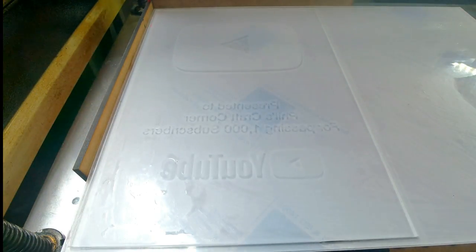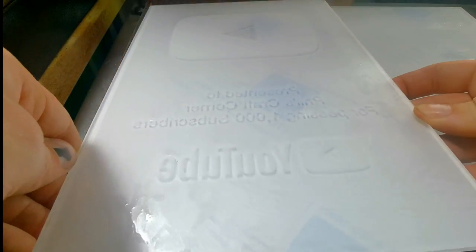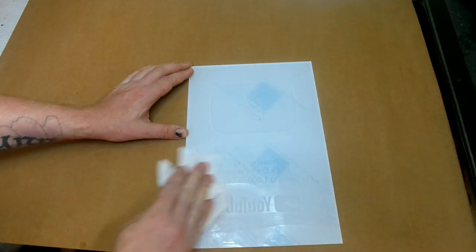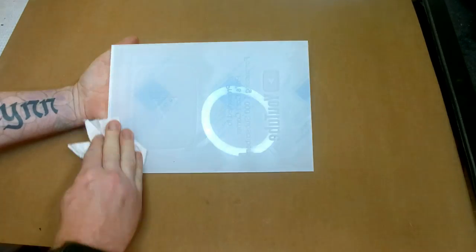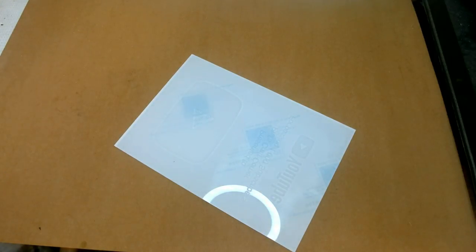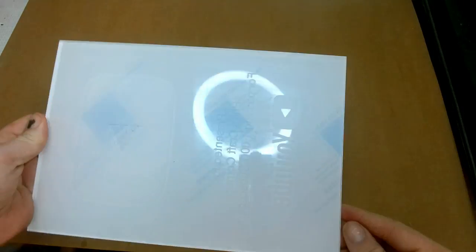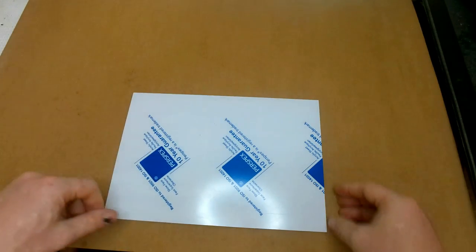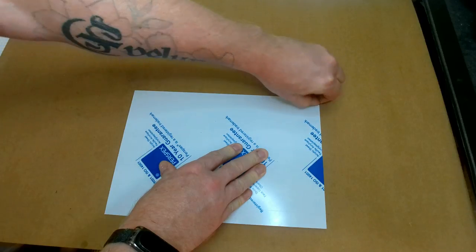As you can see, the smoke residue from the engraving gets caught by the washing-up liquid — that's where the parts are less shiny — and then you can just wipe it off with a clean cloth. Then it's just a case of using some kitchen roll to wipe off the excess washing-up liquid. Once you've got most of it off, come back with a damp cloth for the remaining residue. I left that till the very end after it completed and gave everything a good polish. And now it's time for my favourite part — peeling the back protective layer off and revealing the final engraving.